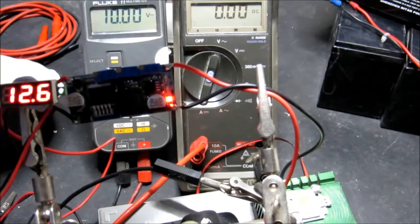Now we're going to look at the second main use for it, which is as an LED driver. Looking at the spec sheet for the 10 watt LED that's on the heatsink, it needs a voltage between 9 and 12 volts, and most importantly, the current should be limited to 900mA.